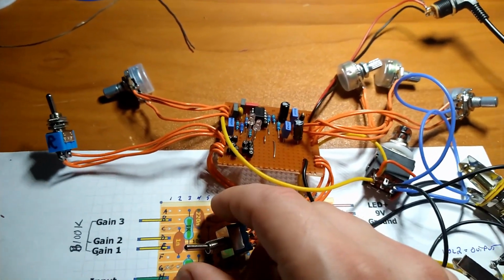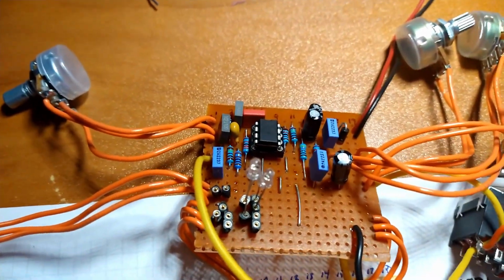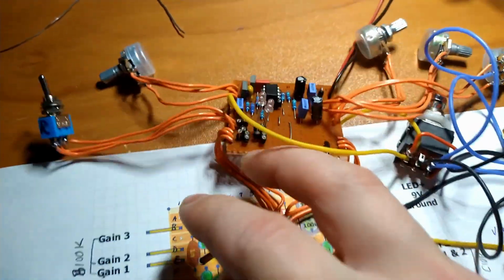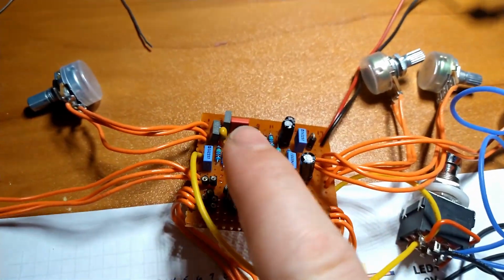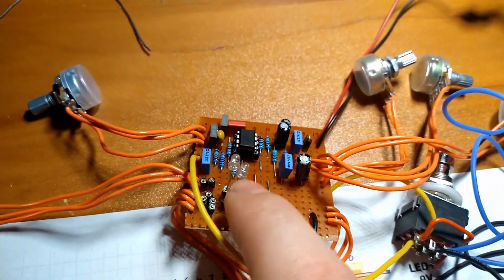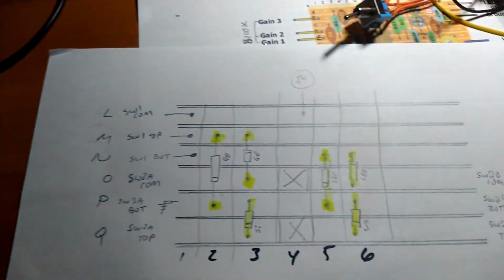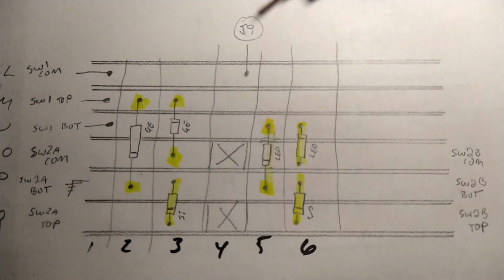And then if it's in the up position, you will have symmetrical diodes, so just two diodes as you see here. And if you put it in a down position, it'll be asymmetrical, so you have one, two, and then on this side right here you can have a third diode. And this is how we set it up on the strip board.